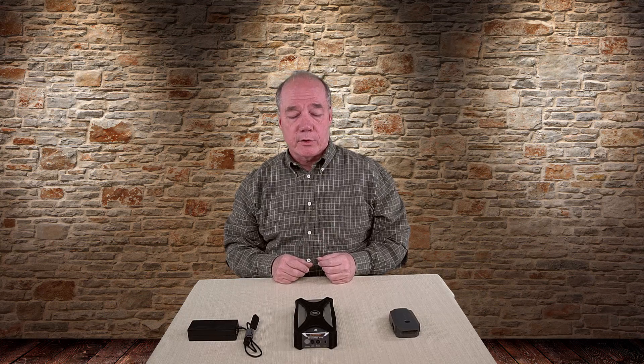In this last section, I wanted to discuss the technology behind the DroneMax M10 and draw some conclusions around the company's claims — specifically being able to charge your Mavic batteries a couple of times off a single charge, and its ability to charge those batteries faster. A lot of you asked questions about charging a LiPo battery faster, because that's not always a good thing and can damage a battery. So let me do a little testing, but first let's talk about the math. The M10 has an internal capacity of 99 watt-hours, and the Mavic Pro battery has an energy capacity of 43.6 watt-hours. Rounding up to 44, that means I need 88 watt-hours to charge it twice, and I've got 99 inside here.